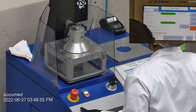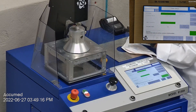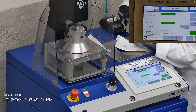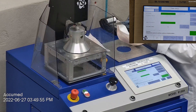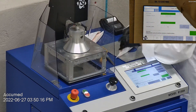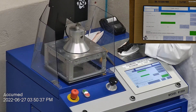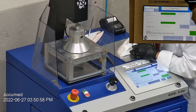Let's see how these test on our TSI machine — we're going to be testing both the filtration efficiency and the pressure drop. This is our TSI machine model 8130A, which is the same testing machine that NIOSH uses to approve N95 respirators. Our procedure is inspired by NIOSH: we run a tester setup, remove the headband from the respirator, place it onto a testing plate to ensure a proper seal, and then completely seal the mask with hot glue to the testing plate to ensure no holes or leakage. The testing plate is then attached to the frame and placed under the TSI holder for testing, and the results are displayed on the TSI monitor.